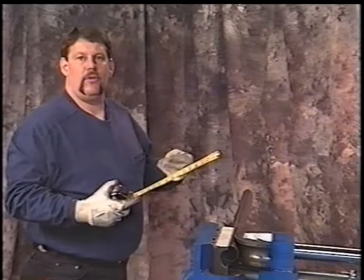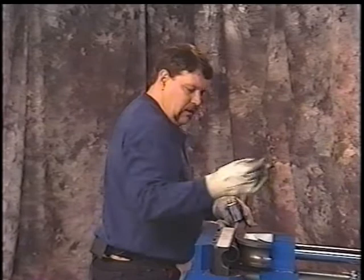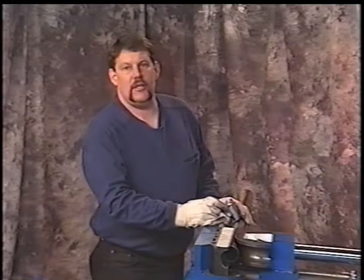Now we'll go ahead and measure the tubing out per the card. And it'll show length marks on here on down the line. You want to make your marks on the seam. That way you've always got a reference point to come back to. You know you've marked it across that point. The next thing you want to do is when you put your rotation dial on, you'll also want to put that on the seam. I'll explain why when we get the dial on.